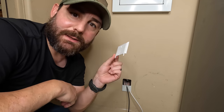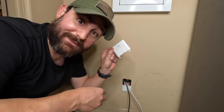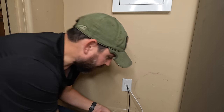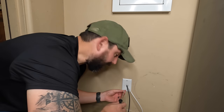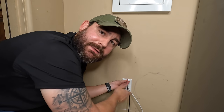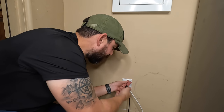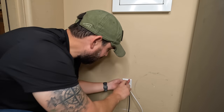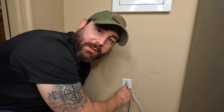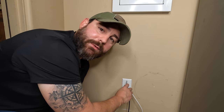This split wall plate cover looks like it's going to be the hot ticket. I already ran my coax through, and since it's a split plate I can just drop it right on. What's cool is I could technically do this on the office side too, but I do want to install the SO-239 bulkheads there. Actually, I think the split plate is a much better idea — no extra connectors adding loss, and it gives me flexibility to run the coax directly into the office.